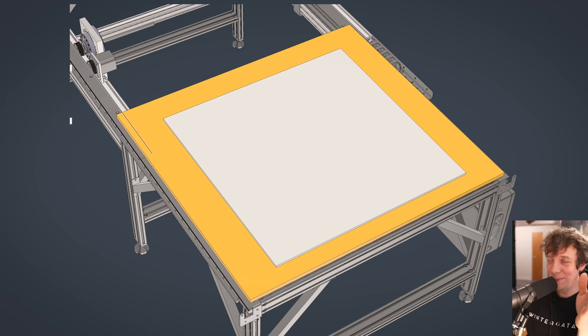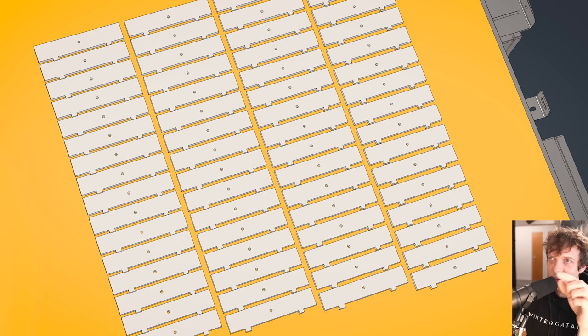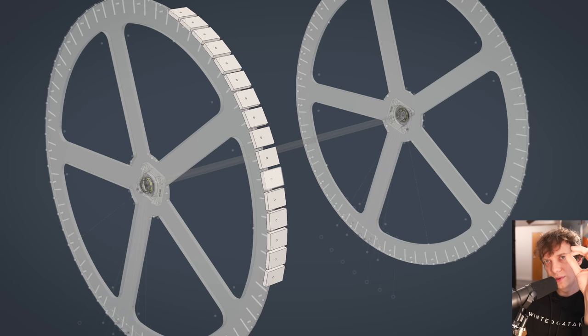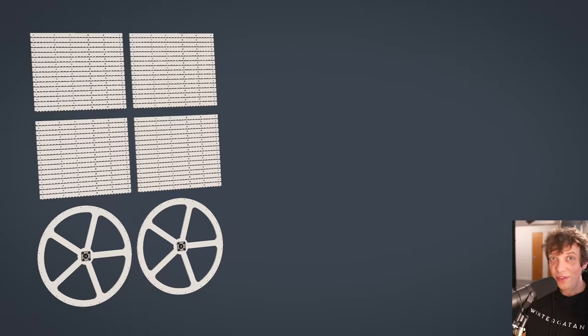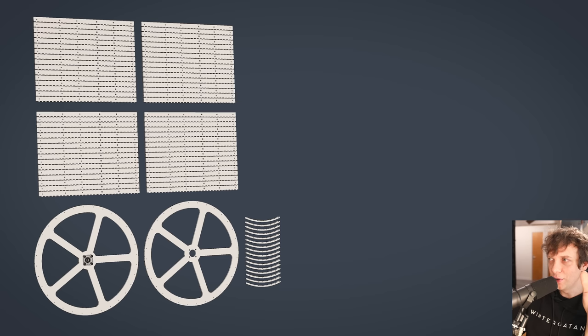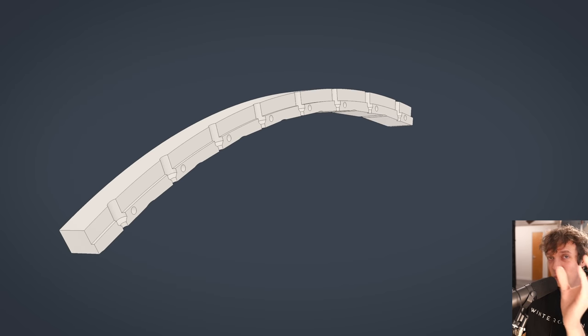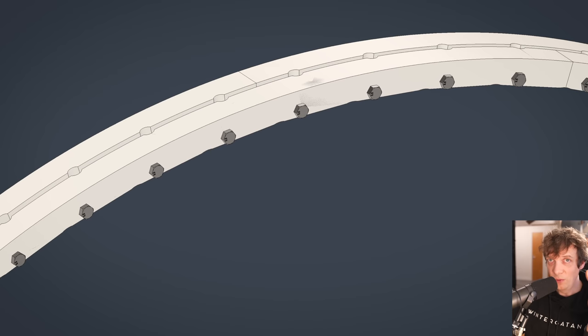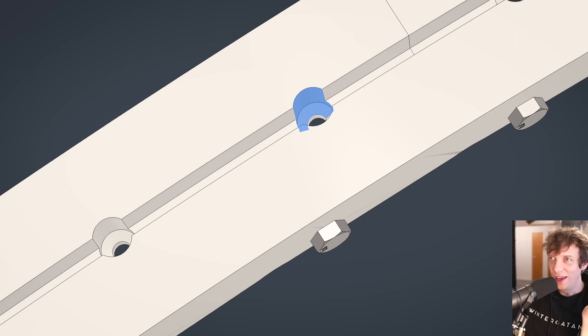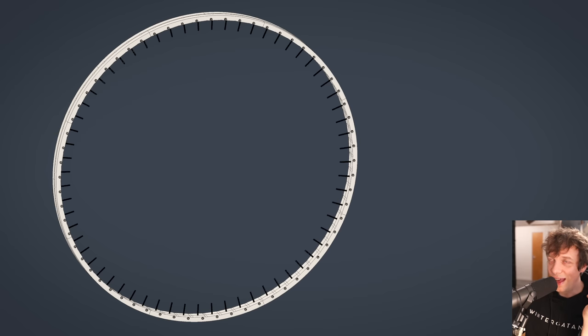Next part: more 10mm plastic stock. We cut test pieces in different lengths to demonstrate wrapping around the wheel, testing exactly what distance between the ribs makes them fit perfectly along with the screw holes. Then we need something to cut the gear from — 20mm stock material — making half-moon shapes that when inverted create a 3D shape which becomes a full wheel. We put it together with 64 M4 bolts, and then add 64 flathead screws in the blue holes.